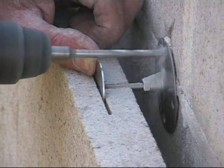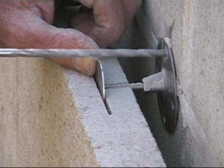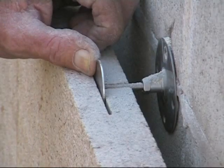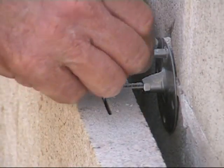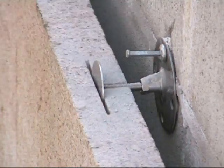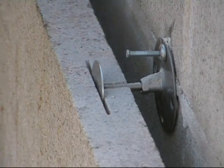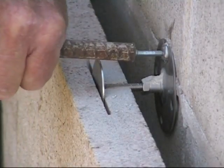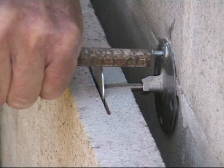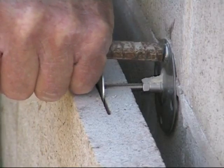If you use our method of inserting the fixing restraint into the panel and then secure it to the substrate with a bolt, pin or screw, you can guarantee that it is fixed and won't shift or dislodge, as is the case with glue or epoxy. In stone clip's case, you will have no worry about heat, cold, sun, rain or panel bending causing release of the panel over the years.